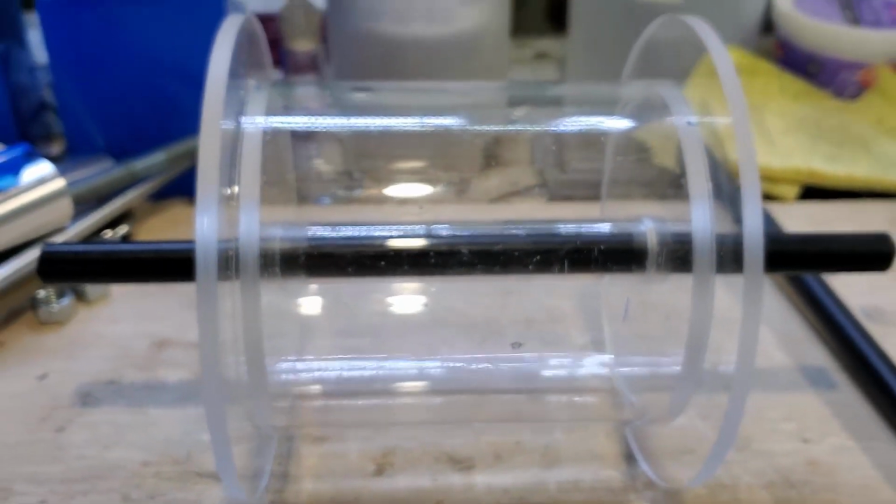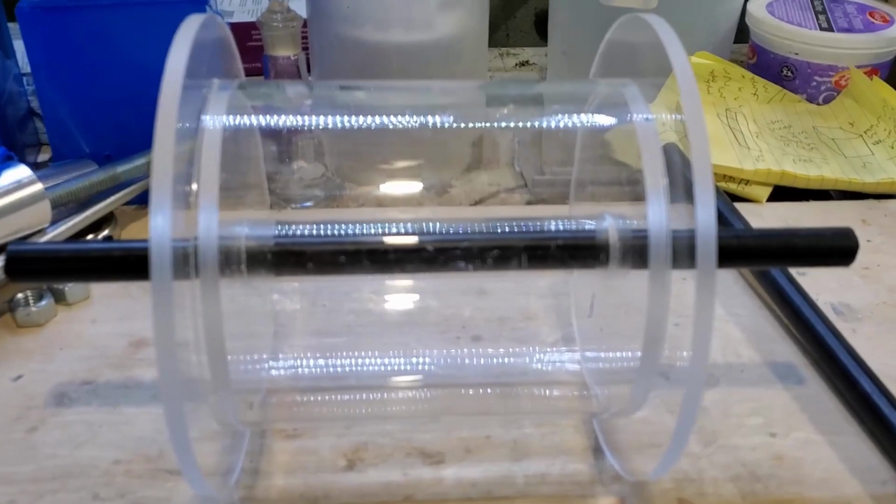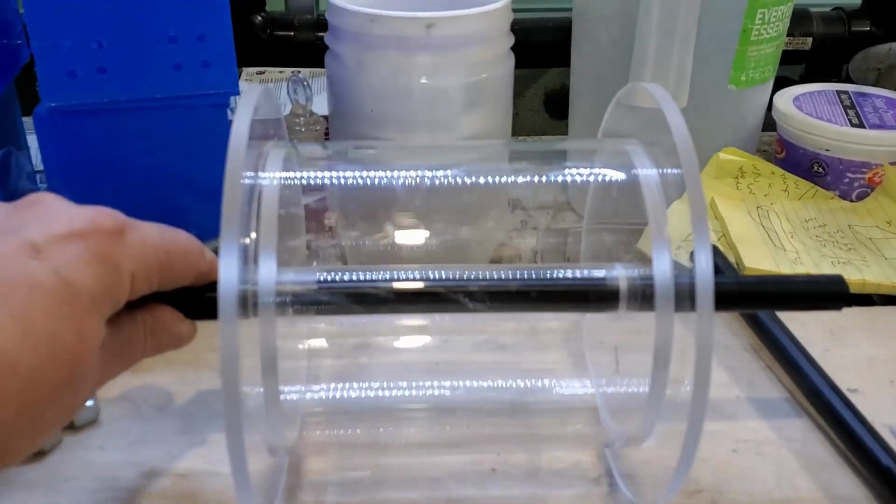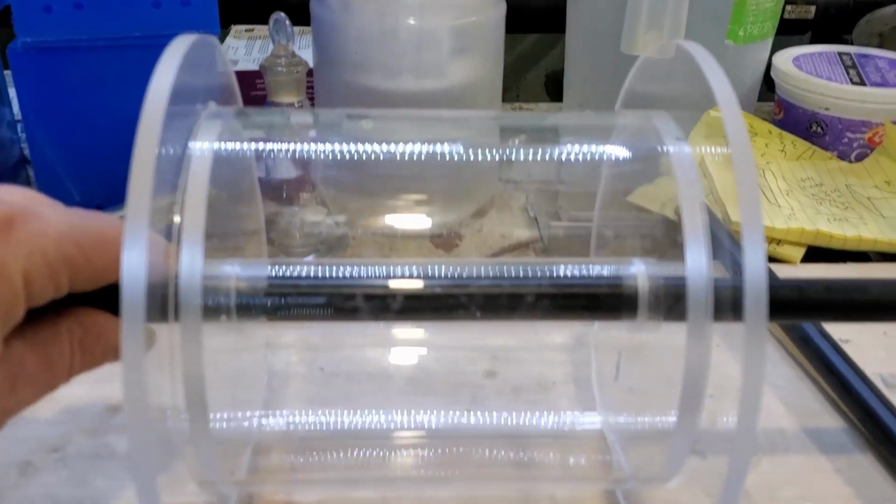And the reason why you're looking at this tiny little strip of acrylic is that when I built the sled, I was trying to make it as square as possible. And I mean, I did the best job I could, but I was like, you never know, is it really perfectly square? And when I finally cut this piece, I was trimming off a piece of acrylic, and see, that is just a sliver, and it came off perfectly fine from one end to the other. So that alleviates that concern. It is as square as I can make it for sure.